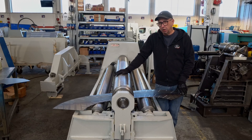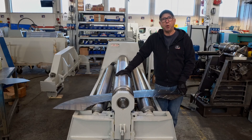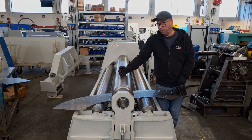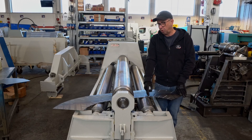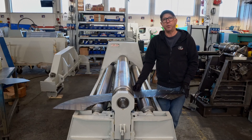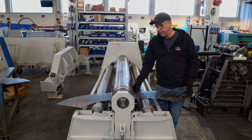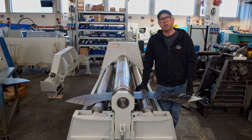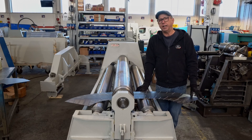When you're doing the eccentric cones you can't roll around the cone bending attachment like you can with a normal cone. The eccentric cone doesn't turn properly in the machine, so what we do with the layout lines is we line up a section parallel to the top roll between the top roll and the side roll. We work back and forth over this section, then rotate the cone manually to the next layout line, doing a section each time we reposition the cone to where our layout line is straight.